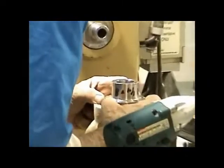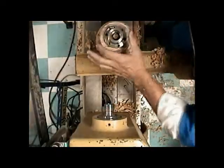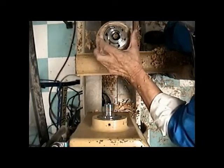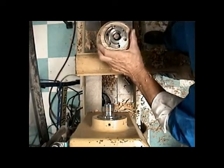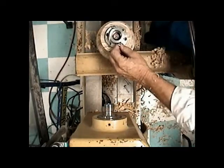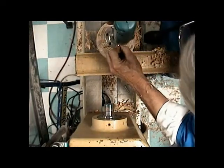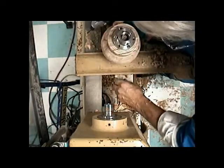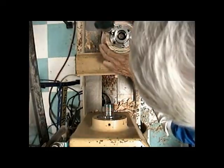You want to take a little more care with your rim than I'm doing here. I'm testing the faceplate — make sure it doesn't rock. We know it can't because we have that nice little concave. I'm going to put one first screw in about halfway, and we can always pull it out and put it in again if we got it off center. Sometimes it'll move as you drive it in, but usually the concave is enough to hold it pretty well in place. I did slide the faceplate around just a little bit so it's lined up better with the circle. If you've got six screw holes in your faceplate, you should use six screws.